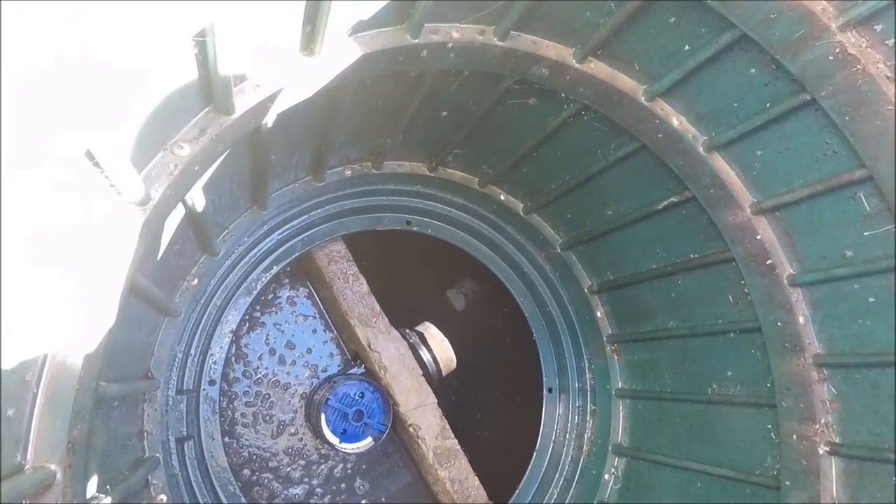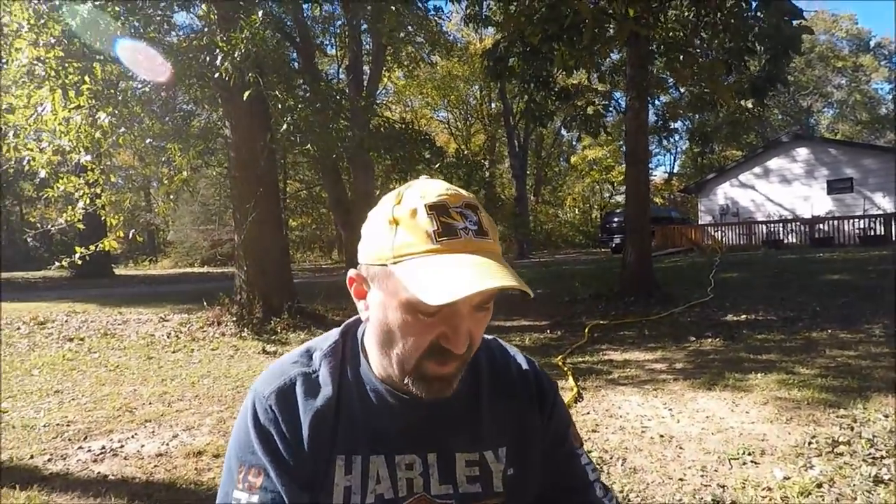They say you should clean your filter once every two to three months; I do mine about once a month just to make sure it doesn't backflow or clog up. Once it gets clogged, water will rise and go over the barrier wall into the second tank, and you don't want big chunks of stuff floating around in the pump tank — it could jam your pump. Also, you should have someone come out with a pump truck to service both tanks, pumping them dry and spraying everything clean.